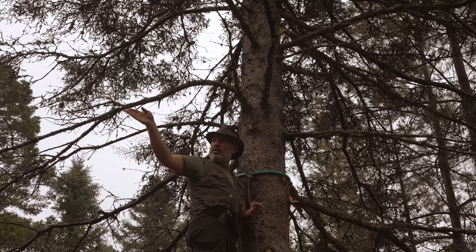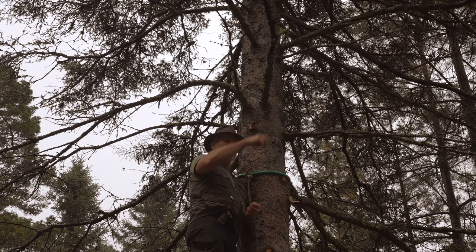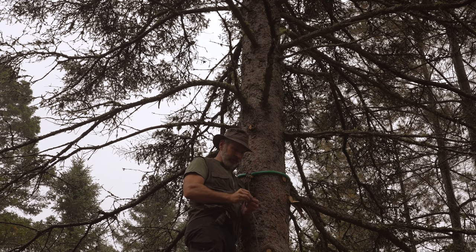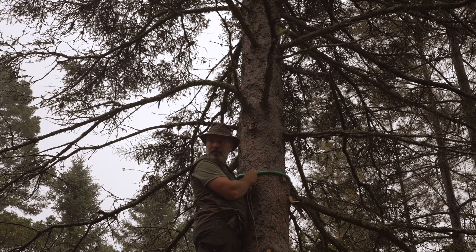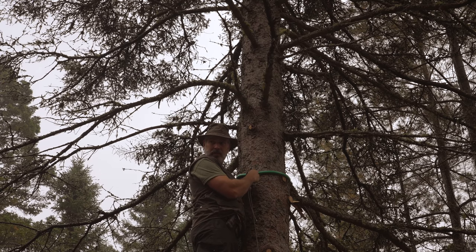There are essentially two trees beside each other in the center of the cabin back there. If I run this cable to that and then from there over on a diagonal — and maybe even to this tree here, which is coming down eventually, so I'm not worried about damaging it — if I run enough cables, one down the center and two on diagonals, I should have enough left-right hoisting options to get all these logs into place. These logs are more than double the size of the ones I used for the first cabin — 14 to 10 inches average diameter, with a maximum length of 27 feet for the ridge and roof beams, and 22 and 20 feet for the wall logs.